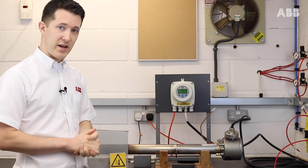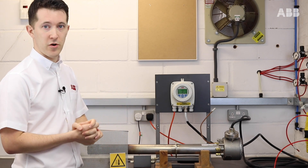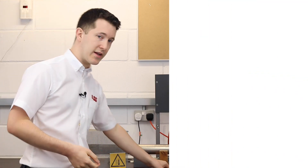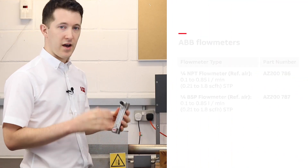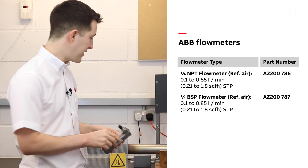The second thing we need is reference air. We get this from a pump, exactly as you would use during normal operation, and again because we have restrictors fitted this guarantees we get the correct amount of flow. If you don't have restrictors, you must use the flow meter and adjust the valve to get around 0.3 to 0.5 litres per minute.